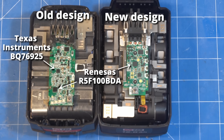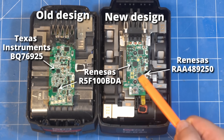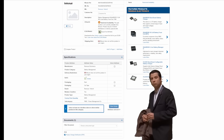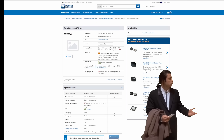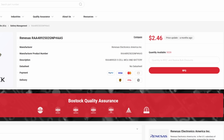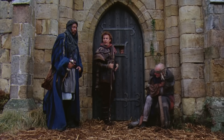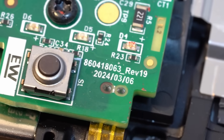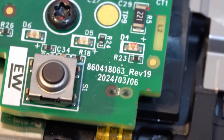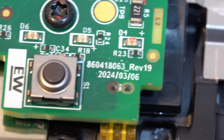For this new battery, Milwaukee has changed to a RENESAS RAA489250. This chip is so new that there is almost no information on it — just that it's a 5 cell battery front end with an integrated microcontroller, so it likely has some autonomous features. There is no datasheet, and when I asked RENESAS for it, they pretty much told me to get lost. Milwaukee has obviously had access to this for some time, as their circuit board design is dated March 2024, so they were likely trialling this chip in late 2023 or earlier.